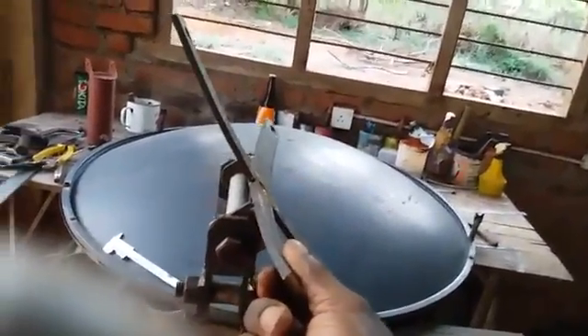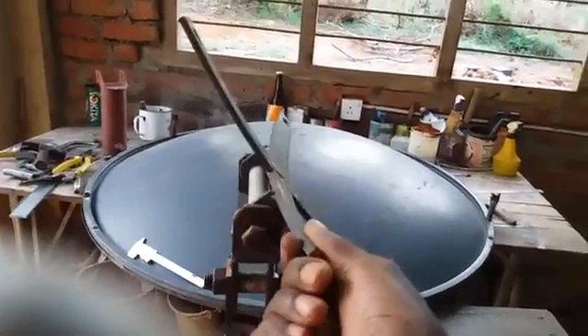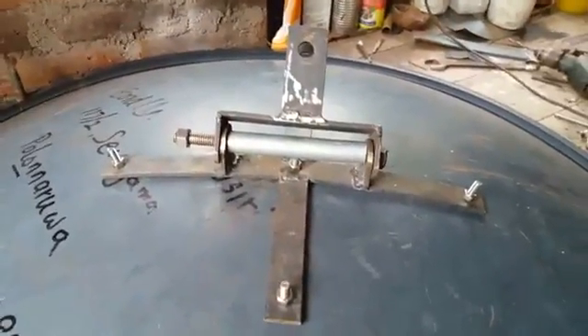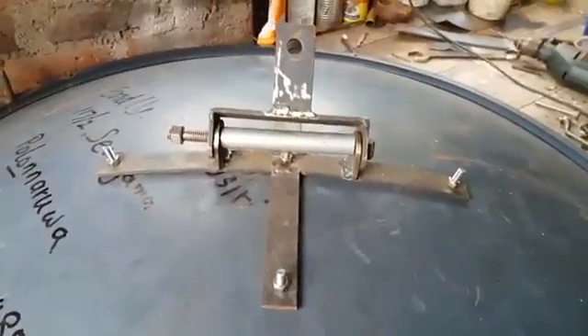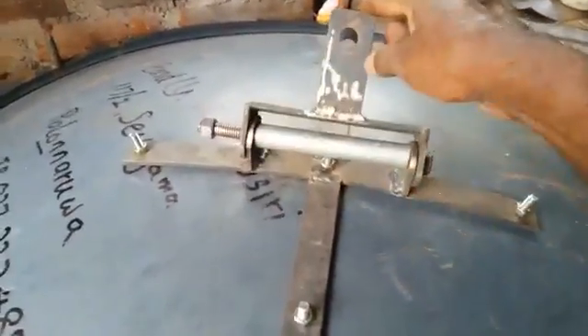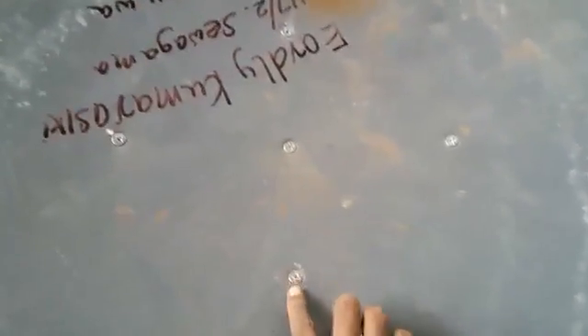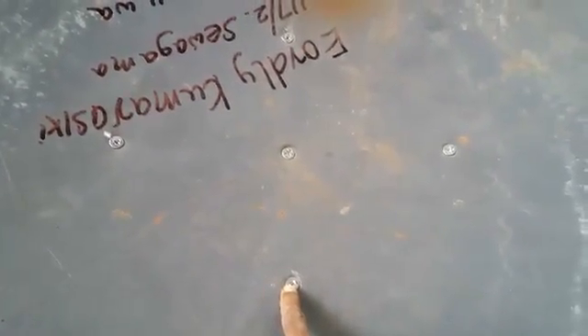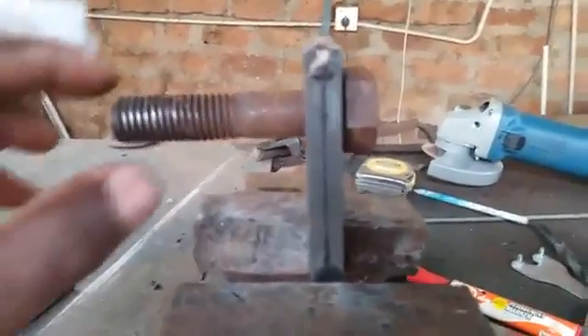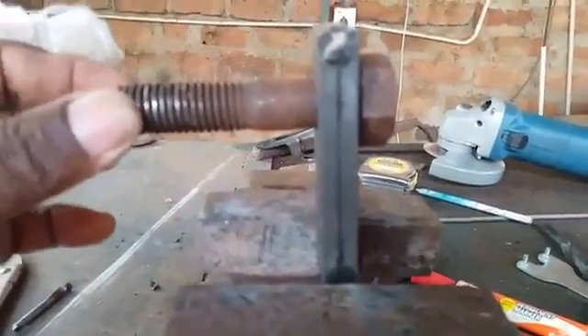Azimuth adjustment — we need only 6.93 degrees from the Sri Lanka location. The top part of the pole mount is already fixed on the disc. The 5 bolts are already fixed. The most important thing is that the surface of the disc and the taper bolt should be equal. Look at this hole and the bolt — there is no clearance at all between the hole and the bolt. It should be like this.